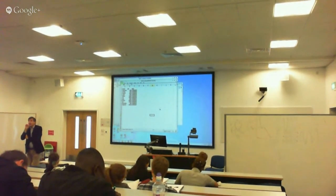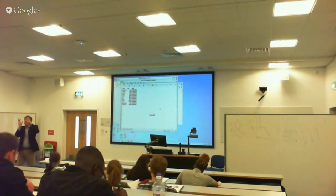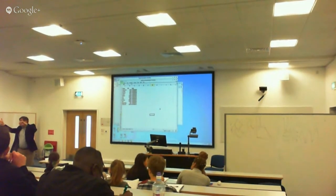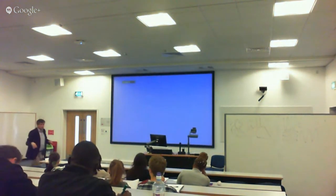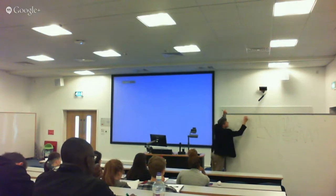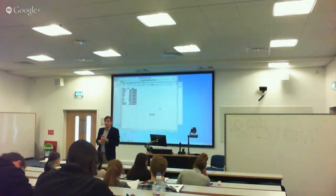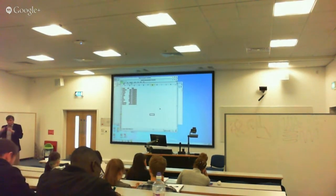Addition polymerization is a chain process. One molecule comes, opens one arm, one bond, to join the next molecule. Once that happens, it has in effect opened an arm, inviting the next one to come in. This is a chain reaction. Once you start it, it goes on until it is terminated. It's a very rapid, simple process, called addition polymerization. All simple polymers like polyethylene, polystyrene, ABS are initially formed that way.